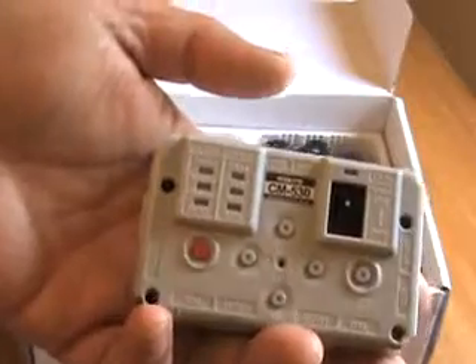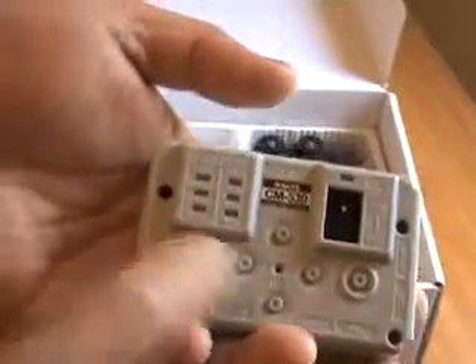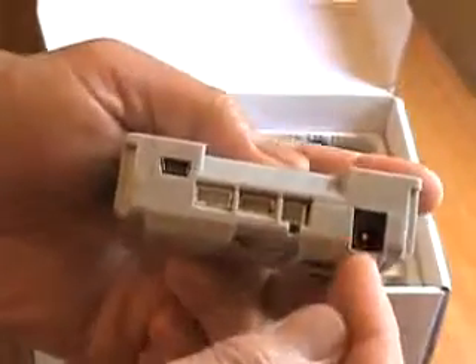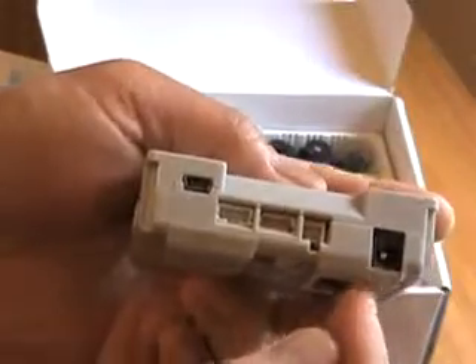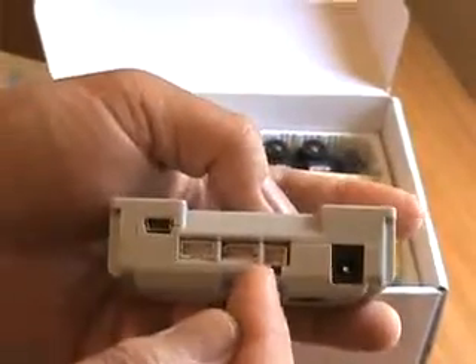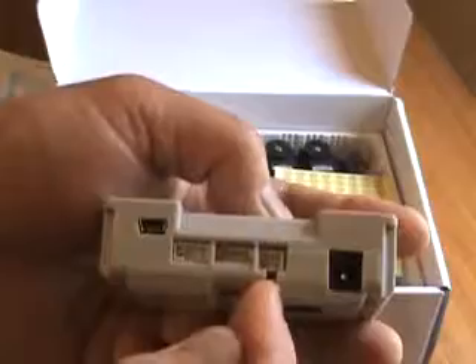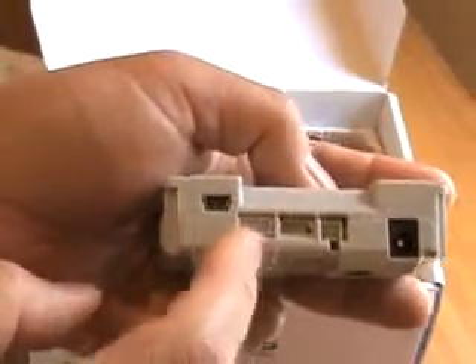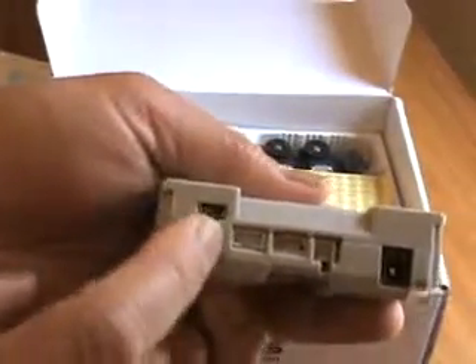The CM530 looks very similar to the CM510, except you have the labels: mode, start, up, down, left, right, power, fuse in the back. As far as power goes, you can use the AC power supply directly into here, and then you can see the two-pin Molex connector type — so you can put a regular LiPo here, or the system they have for six of the AA. You have one of the Dynamixel ports — this one is for either ZigBee or Bluetooth, which you'd have to buy separately. Then you have the USB connection to go to the PC.